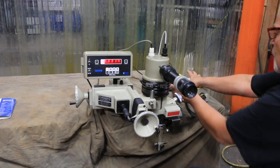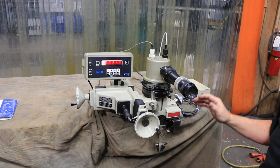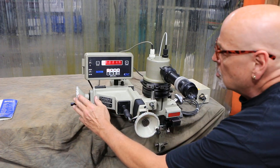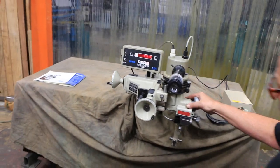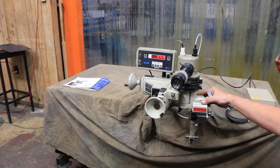When that's all set up on the grinding machine with an actual grinding wheel, you see that. So this is your cross slide, this is your depth into the wheel, and this is your radius. As you rotate this, you get a degree and a radius reading here.